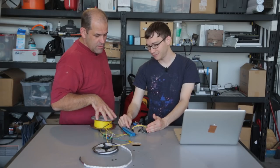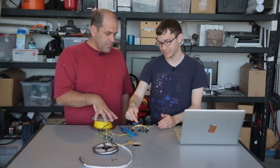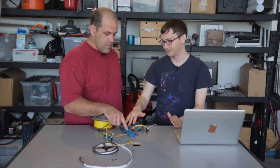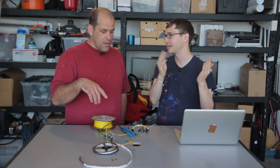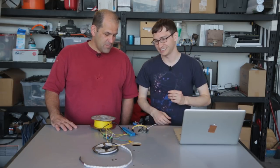I have it set up with an external power supply. From what I understand, with these big 8-channel boards, the Arduino doesn't have enough amperage to turn all of them on or off at a time. So I don't want to burn out my board, so I have this external supply that will supply the power to actually close the gates. You found that you could supply 1 to 4 relays off the board without burning it out, and then things got sketchy. Then I just was scared.